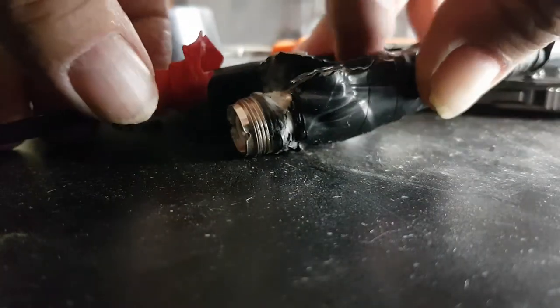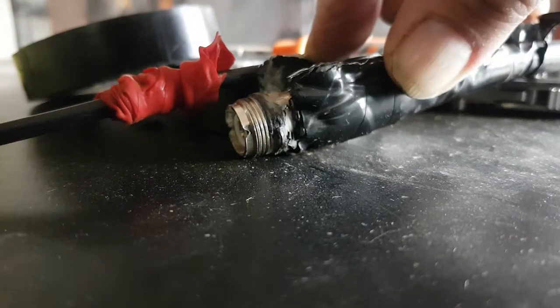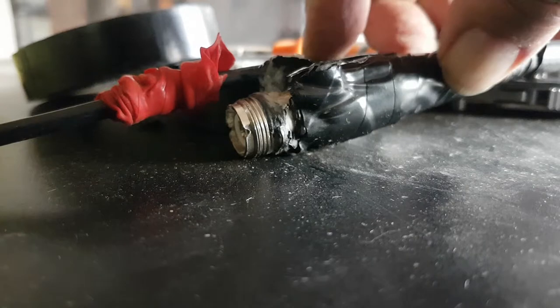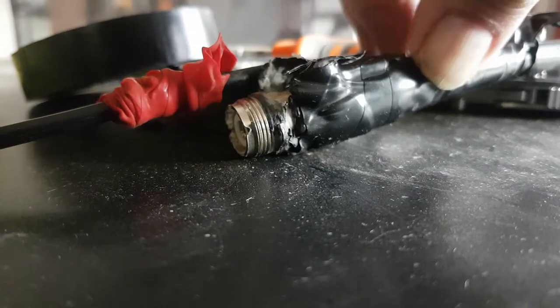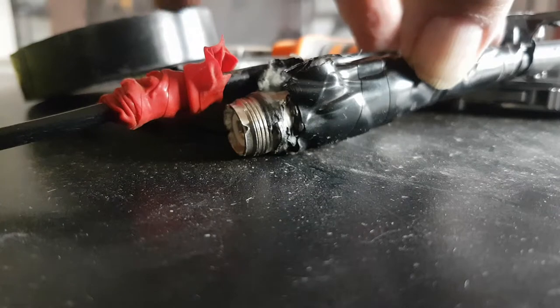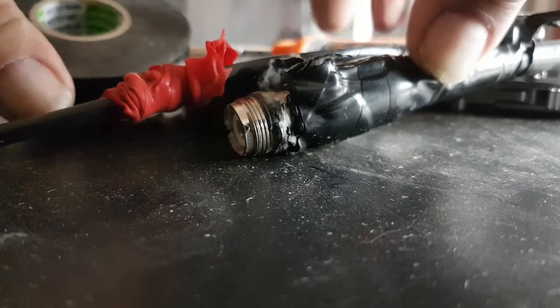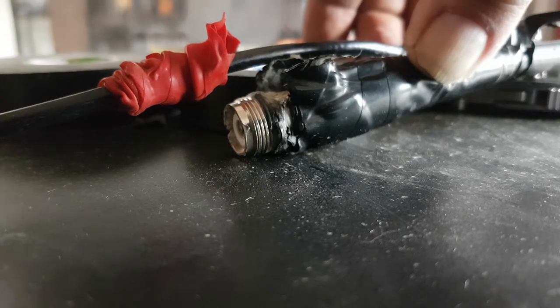So when you're thinking about how to waterproof your connectors, think about it. The Nitto is a beautiful tape and a great permanent solution. For my 2170 antenna - I'm going to put another one up pretty soon for the new shack - I will probably use this on the connectors. But for the other antennas I'm constantly changing, modifying, moving, and using different coax, I'll be using this silicon tape. This is quite expensive - normal Nitto is a couple of dollars a roll, this is nearly 20 bucks a roll. They look very similar but see how densely packed it is - that's 20 bucks for about 3 meters. They call it self-amalgamating tape, 10 meters of self-amalgamating tape.